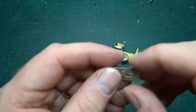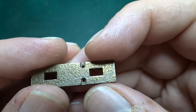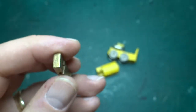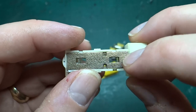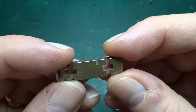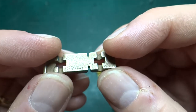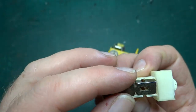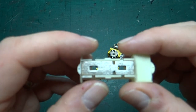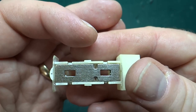The next evolution was to use closed holes but make sure the top piece was more of a horseshoe shape, so material would fall out better during printing. It still fits nicely and you can see how the screws would work, but it's still not brilliant. So we ended up with a third design which just has slots for where the screws go - those holes are now big enough to clean out nicely during the printing process. Once the screws are in through the slots and tight against the nuts, it doesn't matter that they're slots rather than holes - it all holds in place.